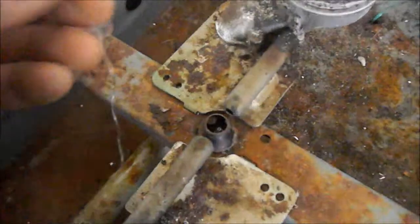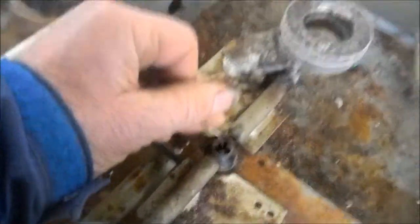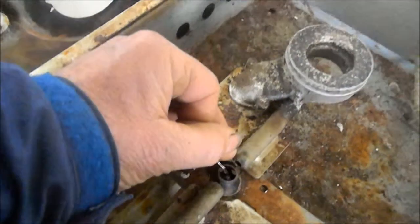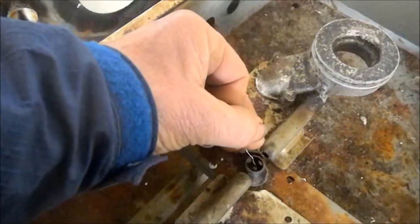So I'm taking this — it's a piece of stainless steel wire from a bicycle cable. Nice and heavy duty wire so it doesn't break off inside there. So we can hone out that little jet right there and make sure it's all clear.